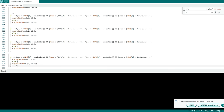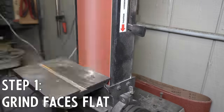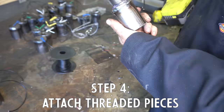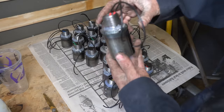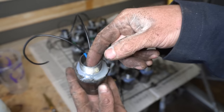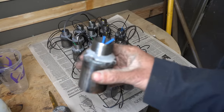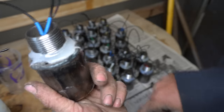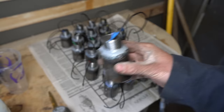Let's go check on those electromagnets. These have set up for quite a while now and look pretty good — let's get tedious. You might think I'm a total idiot for attaching these things with hot glue, but the idea is to pour epoxy in here to protect those tiny 22-gauge magnet wires. The inside of the pipe is pretty rough and the back has that little butthole from the welds, so I think the epoxy will be enough to hold them. I'll stress test them, and if not, I can peel back the hot glue and get a couple tacks.